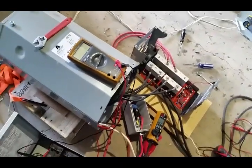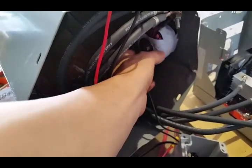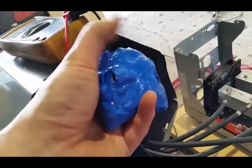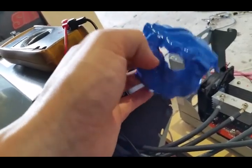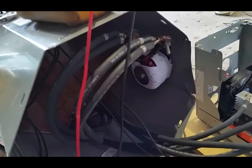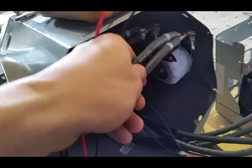Just wanted to add a couple of other points before continuing on. That's the inductor in here, and I put some tape on it — this is thermally conductive tape for heat sinks. When I first tested this thing, it just kind of toasted its original wrapping and melted. They told me it's rated for 150 amps, up to 200 even. I don't believe it can do 200, but for sure 150 if it cools down properly. It is really big and beefy, but it's still smaller than what these things are for. So I've got it bolted in there just so it's secure and not going to hit anything.